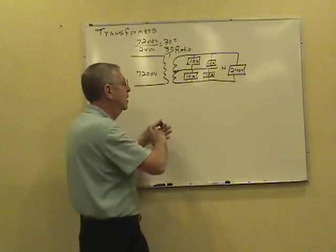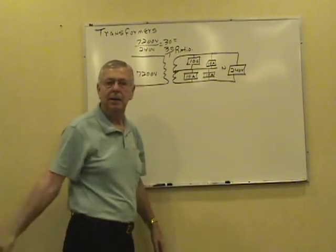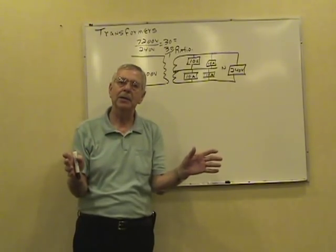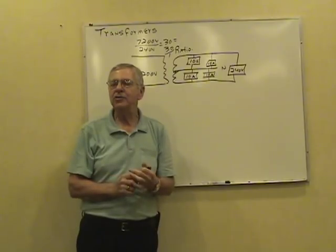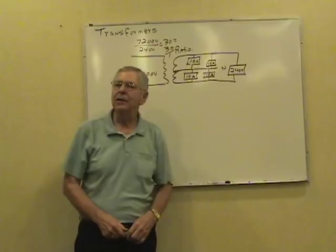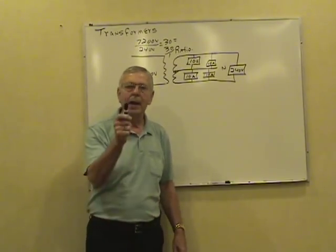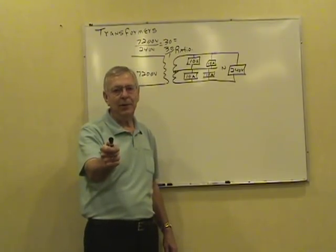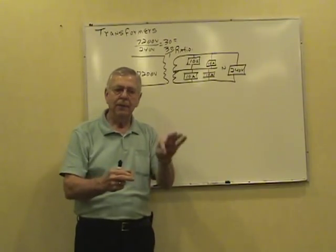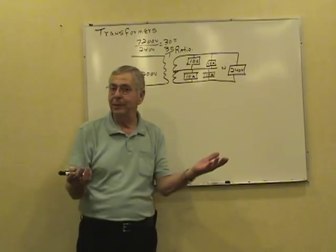At any given instant, you're one direction on one line, opposite direction on the other, and they're going to cancel out here. Perfect condition, zero on the neutral. Absolute perfect balance. Now, another way they might ask you a question concerning the neutral load, 4 10-amp loads balanced as closely as possible. What's the maximum neutral current? Now, neutral load can always get higher than zero, right? I mean, if you've got a perfect balance, flip off one little 60-watt light bulb. Okay, it's not zero anymore.